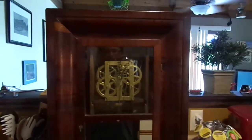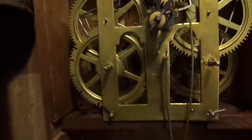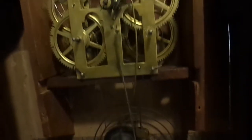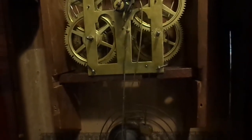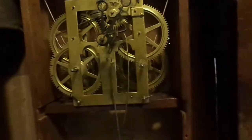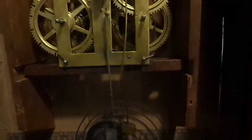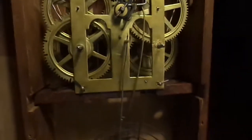She's finally running under her own power. I'm making small adjustments here and there just to get the chime or strike train to run correctly. I have the clock shimmed with a razor blade to make it level. Having the clock level is critical — it has to be level when you're working on it and servicing it, and it has to be level at all times so that when you place it on a perfectly level surface, it will run predictably.